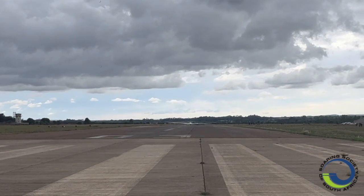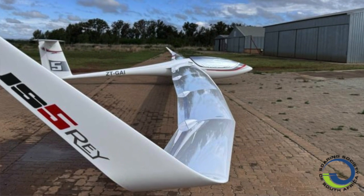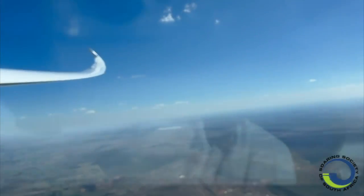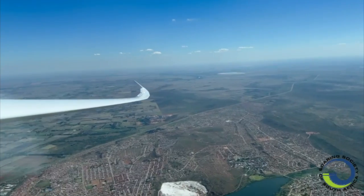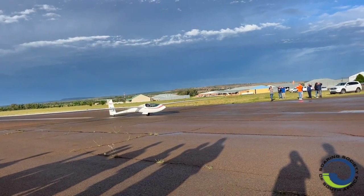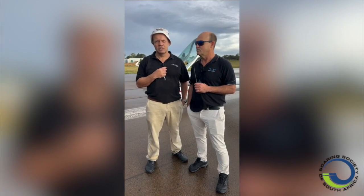Right from the beginning there was a structural problem. You can just make aircraft wings longer and longer, but the performance doesn't go up all the way, because as you get longer you must make the root thicker, and if the root is thicker the drag is higher. So me and Bossy spent a lot of time doing an integrated aerodynamic structural design — we looked for the optimum point for the stiffness strength of the carbon fiber we have. We think 24.4 meters is what carbon fiber gives us as the optimum wingspan from our calculated integrated aerodynamic structural design.